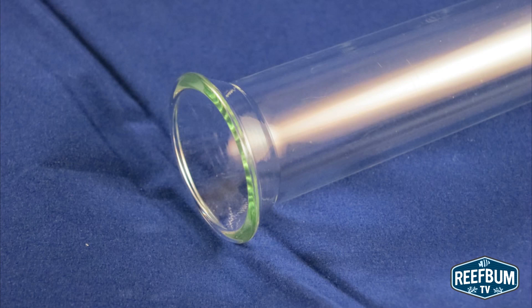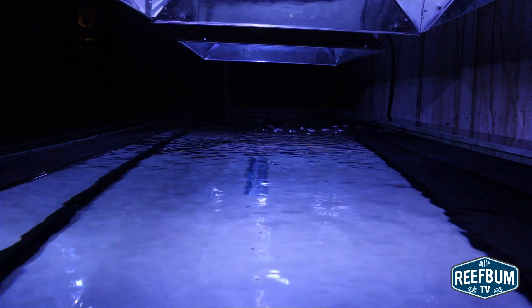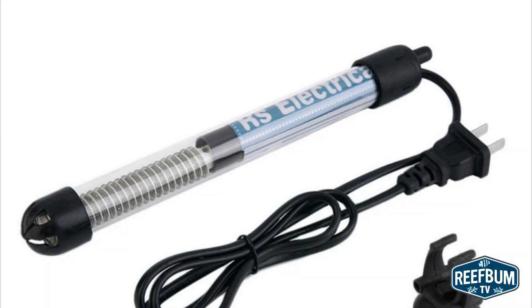If Pyrex glass is used without cooling, then one can expect the same precipitation of carbonate on the glass. Additionally, glass transmits more heat than most plastic, so even more heat will be going into the water, causing this glass apparatus to act just like an aquarium heater. Eventually, high temperatures at the lid could cause the glass tube to shatter.